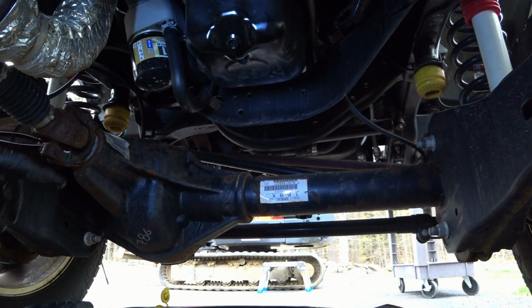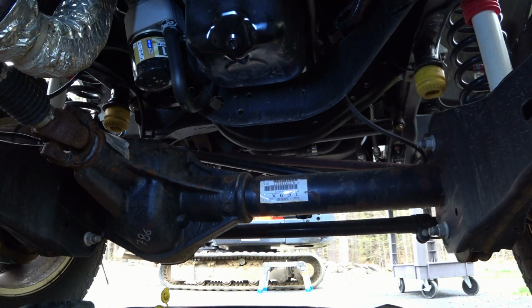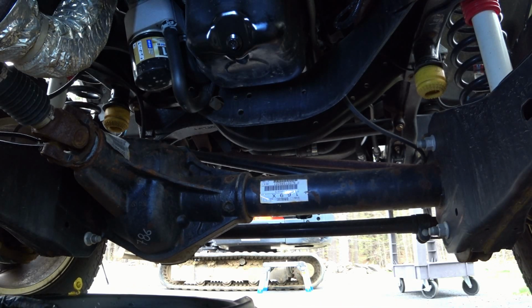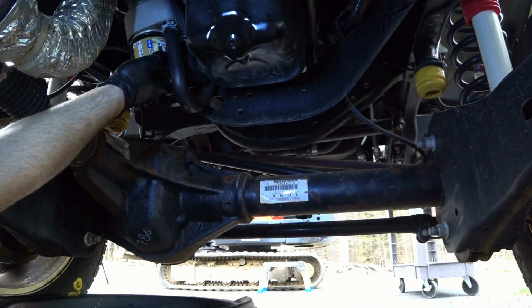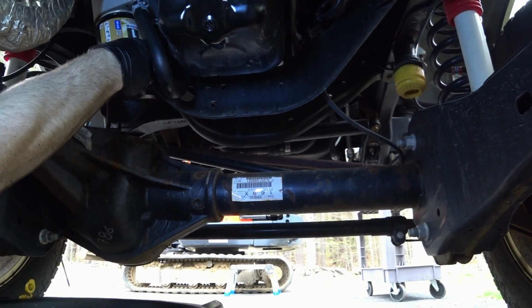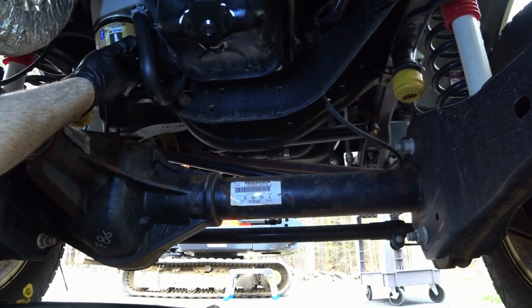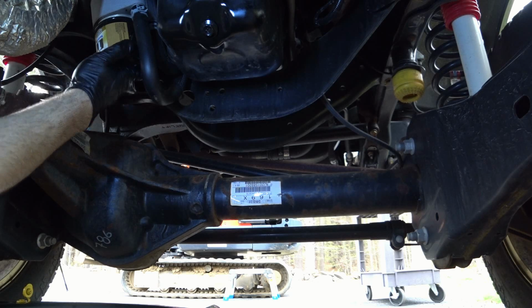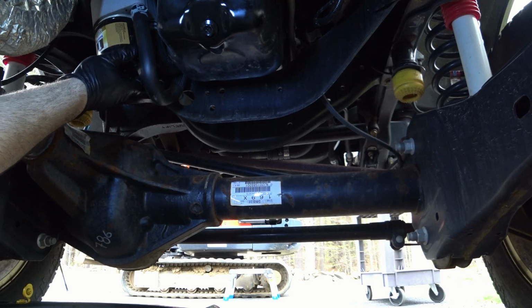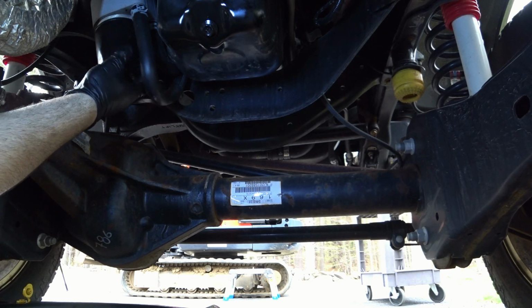So next I'm going to take out the oil filter, which is right next to the oil pan to the left here, and it's in a really nice, convenient location. Last time I only put this in nice and hand tight and then snugged it like 1/8 of a turn. That way it's not cranked in there and it's not a problem next time around.